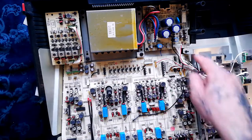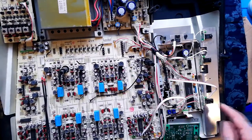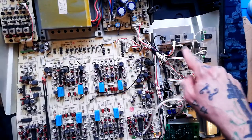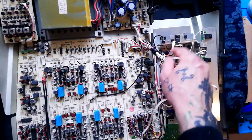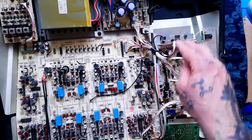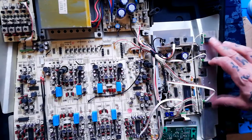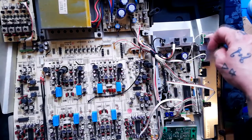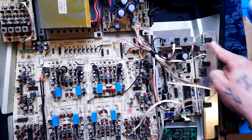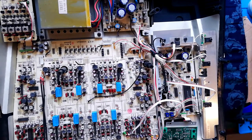That gets distributed via this cable over here. In this section here you can see we've got four different voltage regulators. I guess probably this one up here — there's another large-value capacitor here that's probably more filtering — this is probably for the motor, the 12-volt regulator, just because those two sockets under there is where the transport connected and the power for the motors goes in. The others are probably something in the region of 5 volts for logic integrated circuits and LEDs.